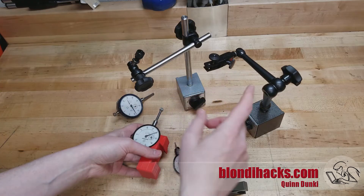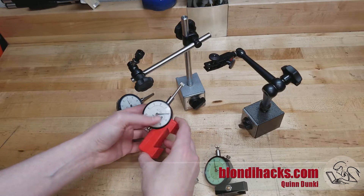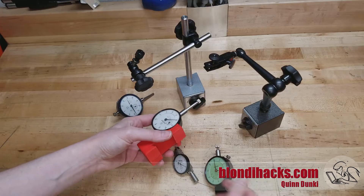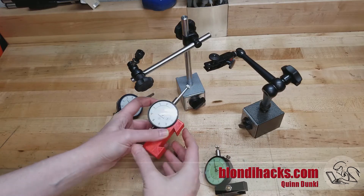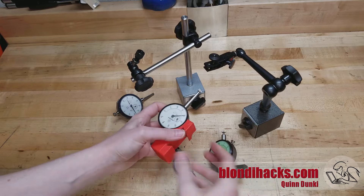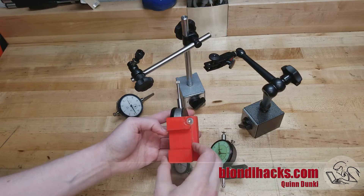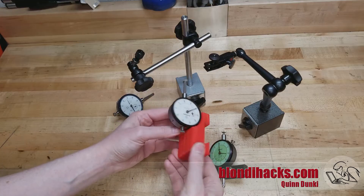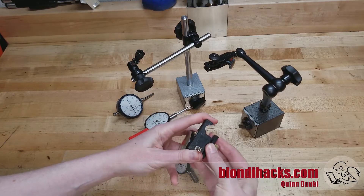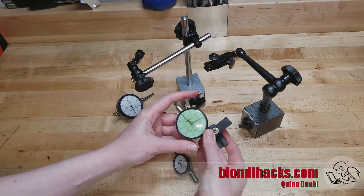When you're first starting out, you can do everything you need with one of these adjustable NOGA arms. However, as you get deeper into machining, you're going to want to start optimizing your processes to get more efficient, and that means customizing indicator mounts for specific situations. One of your best friends in that regard is the 3D printer, but you can also make these fixtures in various other ways — out of wood, on a mill, however you like. The idea is that these are quick to install for a very specific task you do a lot. This one fits on a quick change tool post, and this one is a ways-mounted clamp that clamps onto the ways and allows you to measure travel and set stops for the carriage when turning to a shoulder.